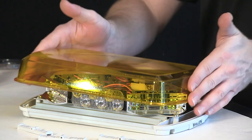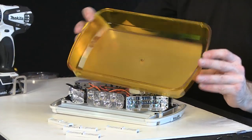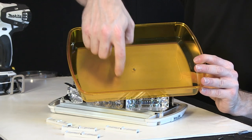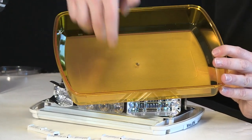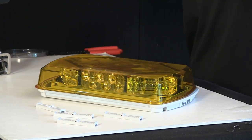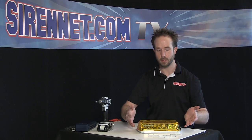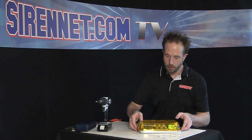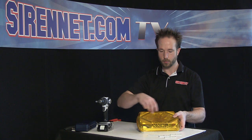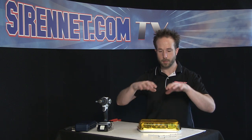The top now becomes free. You can see it's a one-piece polycarbonate molded dome. It has etched optics in the top here, and this is actually a rough side in here — you can hear by my nail scraping — versus a smooth side here. This just helps deal with intensity coming down on the mini bar and keeping the electronics inside safe and free from grit, grime, and overheating. Also what it helps do is take the intensity of the modules around the edge of the unit and keep the light output to the sides, versus putting light output through the top of the mini bar.